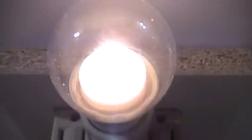That's what the bulb looks like. I'm going to turn it down. It's barely on — you can see that. Now I'm going to turn the light on and we'll see what the milliamp draw is. I haven't touched it — it's 2. That's really the lowest we can go. I don't know if you can see that. Just barely going, but I think that's remarkable that we can dim this bulb.